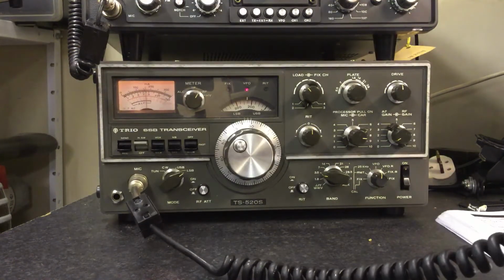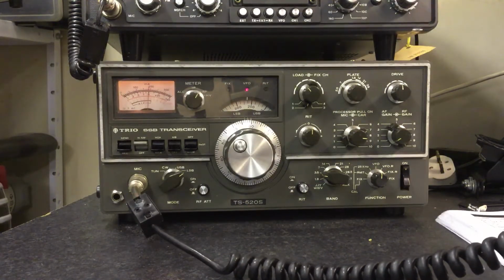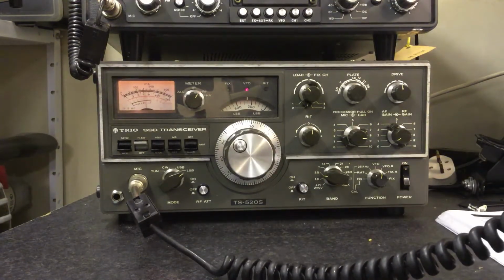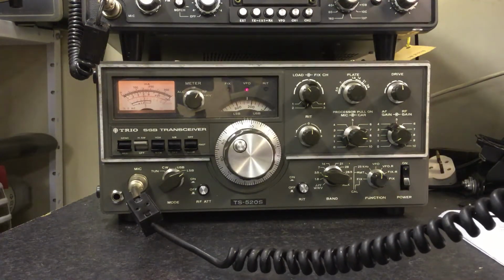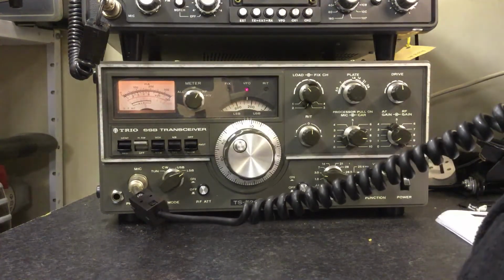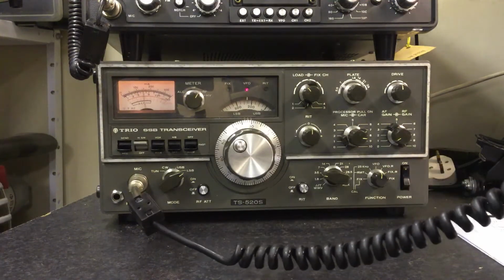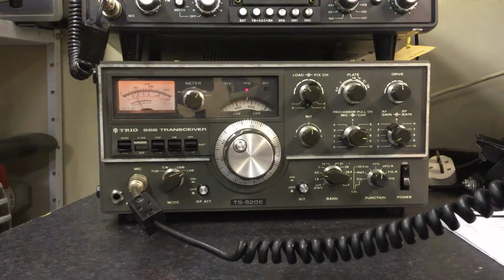But the radio I'm using tonight, Peter, is a little bit older than yours. It's a Trio Tango Sierra 520 Sierra. Just checking the meter now, running about 125 watts barefoot. I know on the tune up it will go up to about 150, 160 watts when tuning. SWR's a little bit high, showing 1.5 on the meter, but that's because I've shifted up the band and haven't retuned the ATU, so it's all a bit false. You know, I can get it down 1-to-1, but we know it's not.